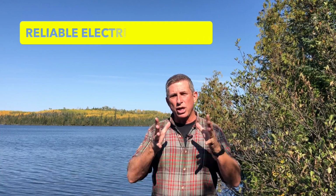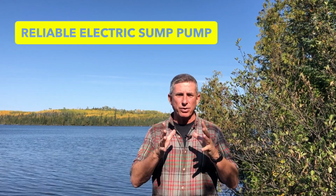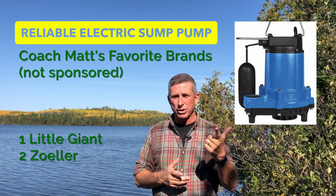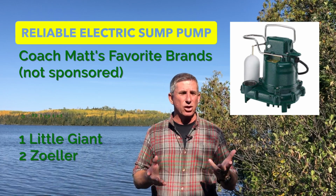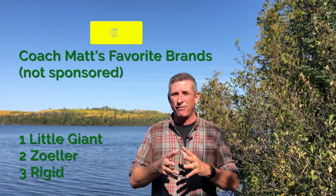Second, a good, reliable, emphasis on reliable, electric sump pump. Ones that I've used over the years have been Little Giant, number one, Zoeller, number two. And then if I was in a pinch or I didn't have any other choice, I might go to the box stores like Home Depot, and I've used the Ridgid brand. Stay away from the Everbuilt brand. Never had good luck with those, and I've replaced more than I have installed. Sorry, Everbuilt, the product just doesn't last that long.